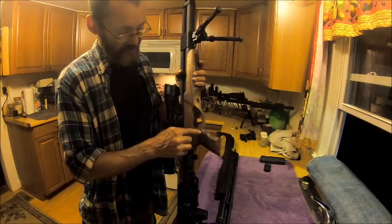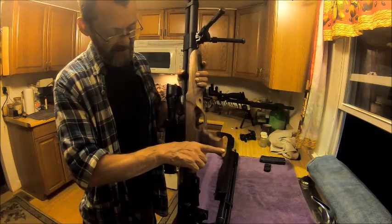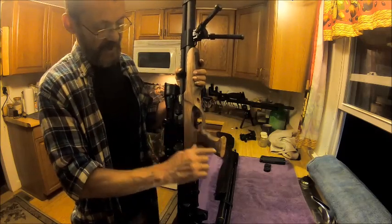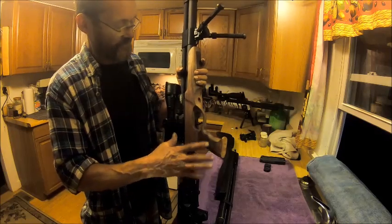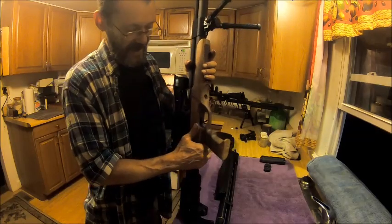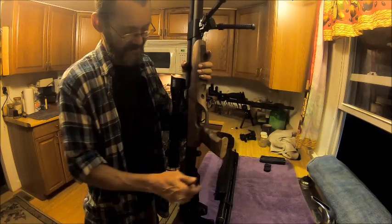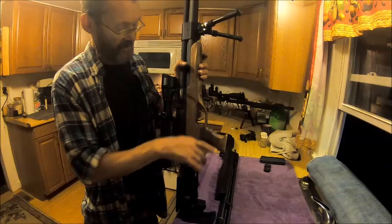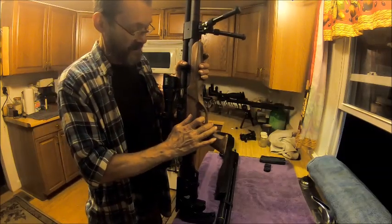When you're working with wood, you have to pay attention to that grain. You want that grain to be as long as possible — a sideways grain would be even better, but then you're going to throw off all the rest of the grain. So it's kind of you're damned if you do and damned if you don't. If you just pin it, you ain't got to worry about it. We're probably going to pin this if it ain't already done — which I'm sure it ain't.